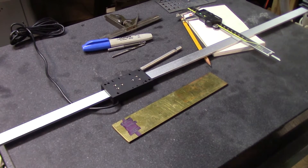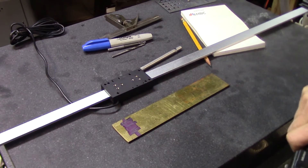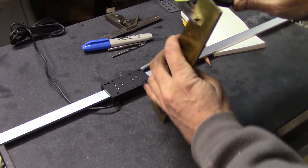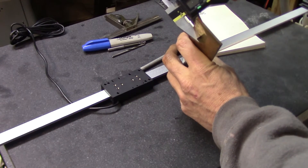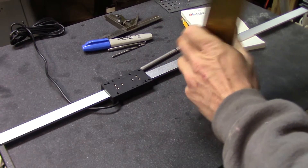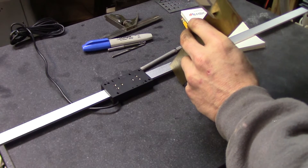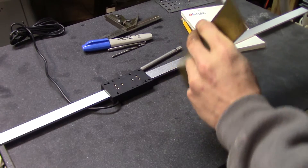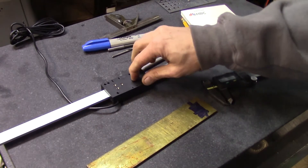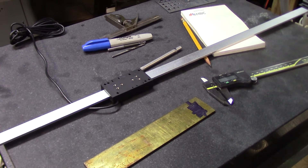This piece of brass is probably 325 thou nominally, though it's not perfectly flat. I'm going to try to counter-bore about halfway through. I don't need a ton of thread engagement on these — I just need enough to hold this piece on — so I think it'll be fine. Let me grab a punch, go to the drill press, drill and counter-bore these out just a bit.